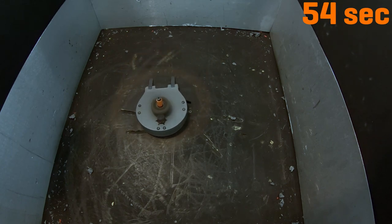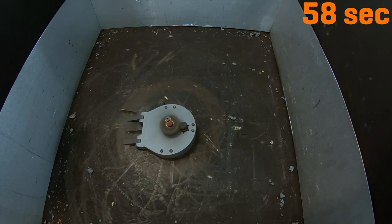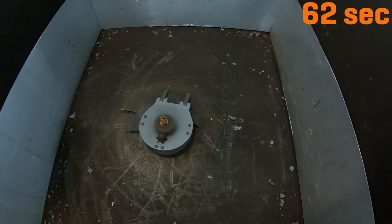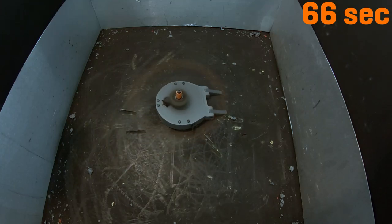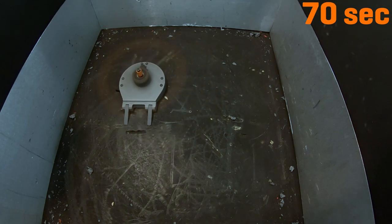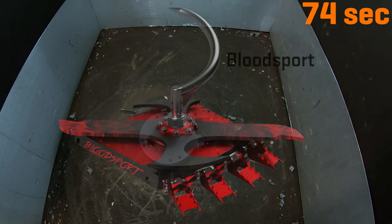The fourth, and in my opinion biggest issue, is that simply, as of now, I can't self-right. My tests with a plastic weapon were deceiving, as that resulted in the bot having an incredibly low center of gravity, whereas now, the center of gravity is just above the lid of the chassis. There are a few ways I can address this, but the easiest is adding a righting arm of sorts off the shoulder bolt, similar to the design of Bloodsport, which I plan to design and test over the next week or so.